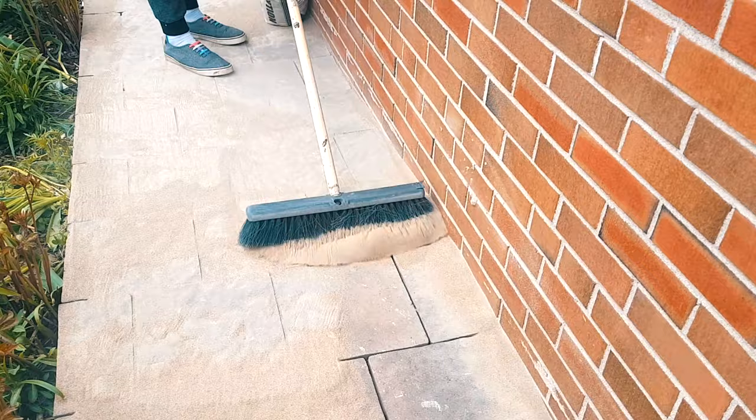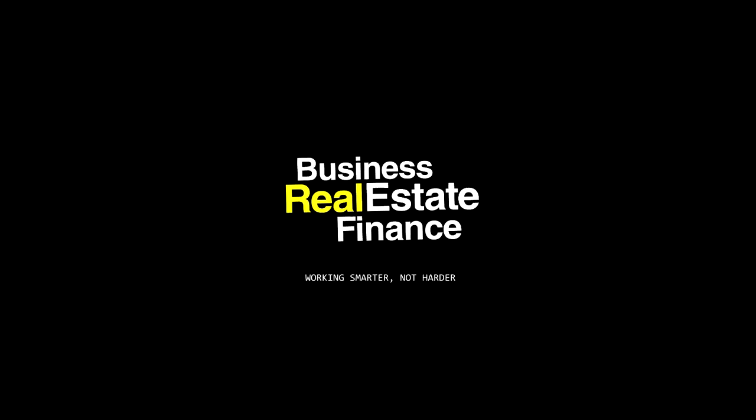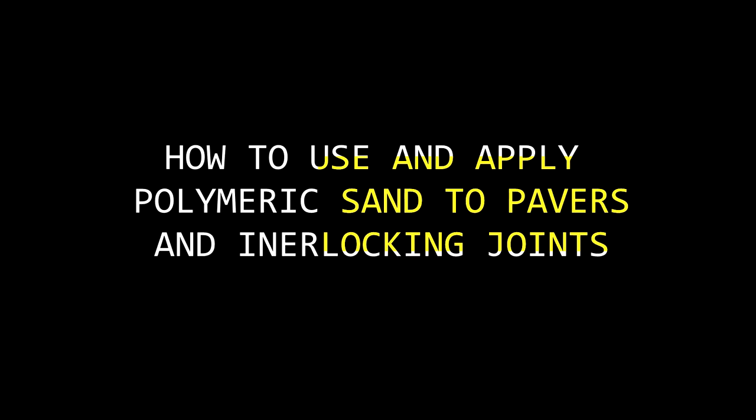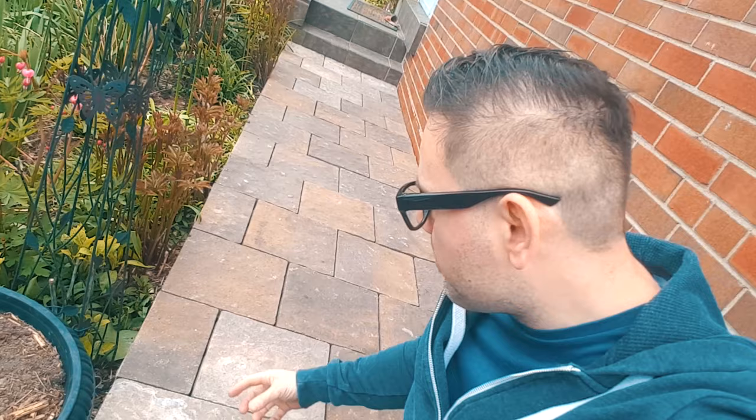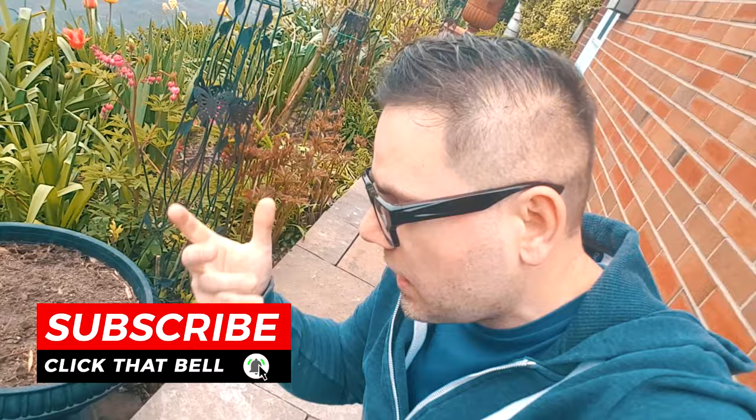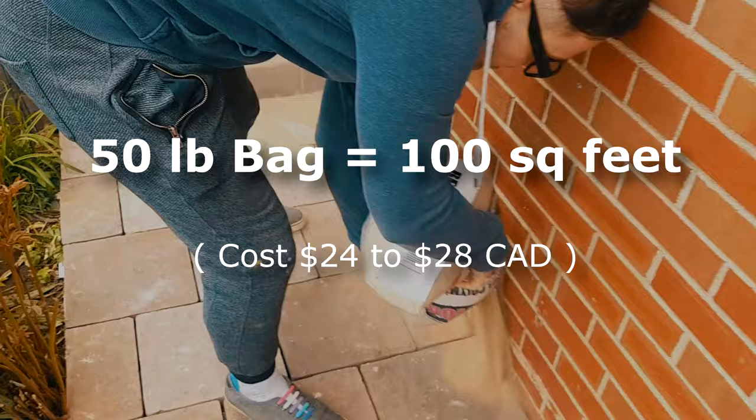On this video we're gonna put polymeric sand on this walkway. Polymeric sand is a mixture of sand and some polymers that creates a strong bond — kind of acts like glue. You put that in between the joints so nothing's gonna go anywhere, but it also makes sure that no ants, no bugs, nothing grows from underneath and nothing falls in there. It takes maybe five minutes, put a little sprinkle of water, and then it's done.